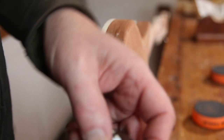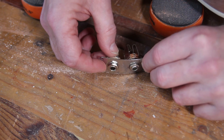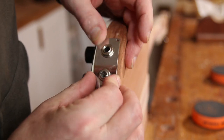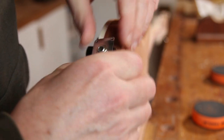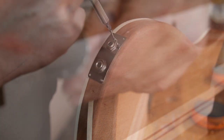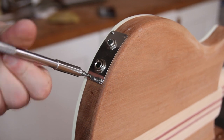I've just put this little jack plate in. I've done a little work on these — I've actually spaced out the sockets on the back with a nut and a washer on each one, just so I haven't got that piece of threaded socket sticking way out as it was before. I think that looks a lot better. It's always these little small details that you fix up as you go along that make the difference. Depending on which way the sockets are oriented it can make it a little bit difficult to get into the holes. I might even cut that central bit out just to get a little bit more wriggle room.